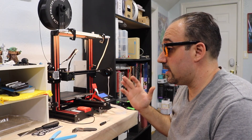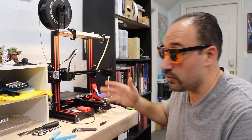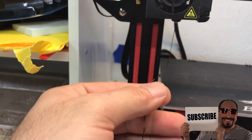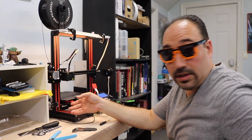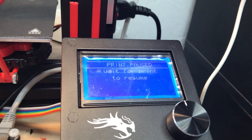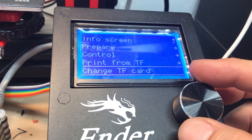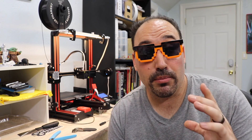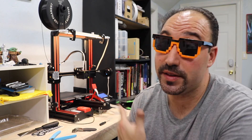Now it's going to preheat the head and alert me when it's time to extrude some filament through to make sure it's running smoothly. It just beeped — it's preheated and ready to go. Now we just press the button to continue extruding out some filament. It removed all the old filament and the new filament's loaded. From this point we're going to upload the stuff to OctoPrint, go ahead and print this G-code file. It's going to take about an hour. I'll get back to you when this is done printing.